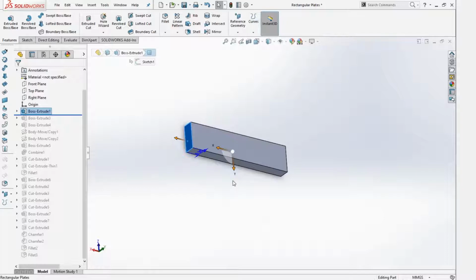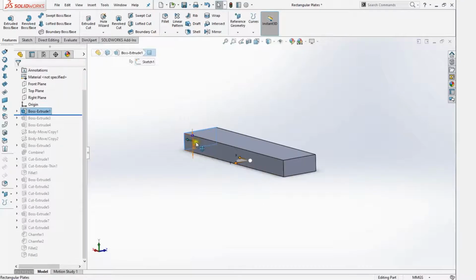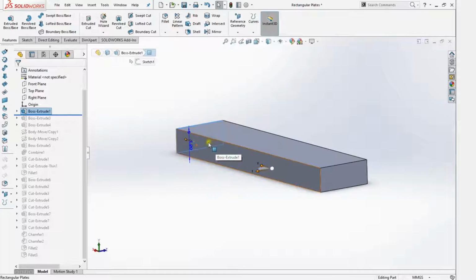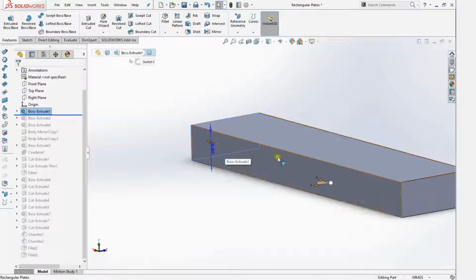have it. But it wasn't so easy as it sounds, because this was supposed to be made in a material that doesn't do very well in the solution that we use to dissolve the parts. So this has to be made in a split mold, and I will show you how to do that now. So first of all, this part is supposed to end up as 3.2 millimeters, but I added 2 millimeters thickness to it, and I will show you why later on.